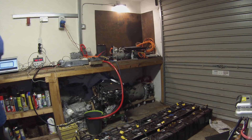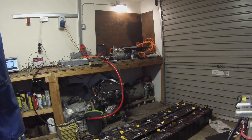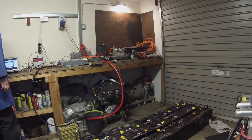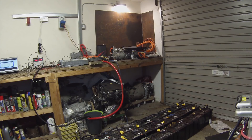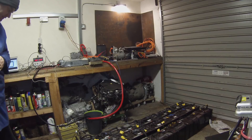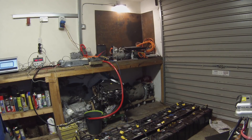I'm going to start easing us back off here. We are back down now to 6.4 kilowatts, 27 amps to the battery. Down to 3.2 kilowatts, 14 amps. C2 — down to 5 amps and 1.2 kilowatts. Our heating element is blowing away early. We go for zero current command — the battery will probably only get us down to around 2 amps with this particular setup, which is fine — and we can switch off the charger.